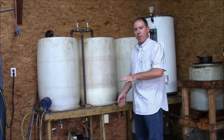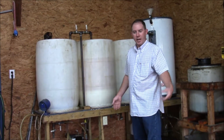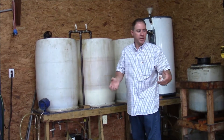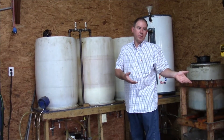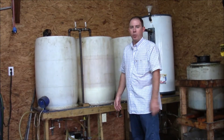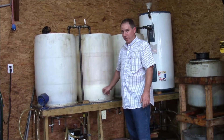If I take a little biodiesel off with that water, it's no big deal. I can set it off to the side, dip the bio off the top, load it into a separate collection vessel, and let that bio build up to drain at a more convenient time. But the more soap you get out, the better.